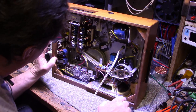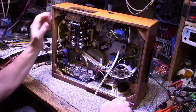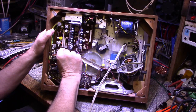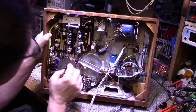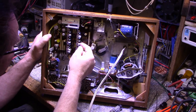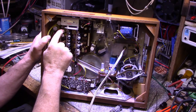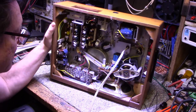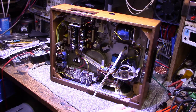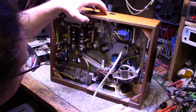We're going to have to be checking capacitors, grid capacitors, all kinds of blocking capacitors. Check out these switches. They're going to need to be cleaned. Oh boy. Thankfully, we got no bad transistors yet that we know of. Electrolytics, they're all stood up. Yeah, so we're going to have to give this a complete going over. It's going to be a while. Just the lubrication portion of it is going to be a while.